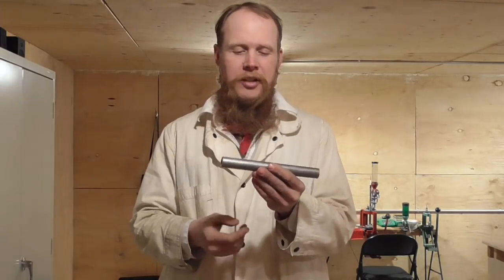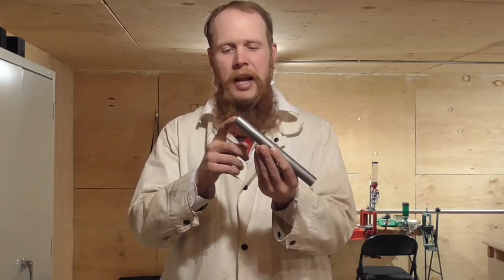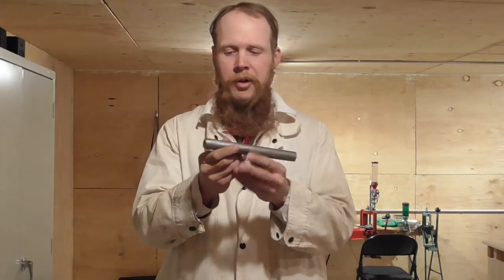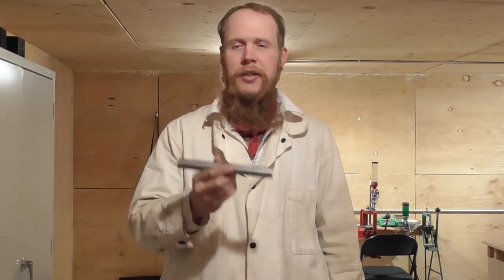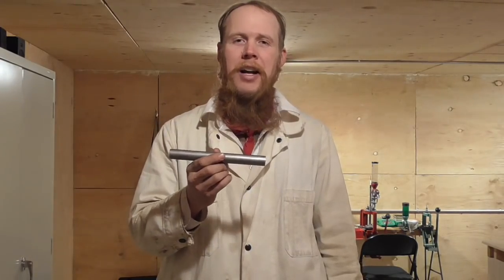To test my hypothesis, I'm going to take this piece of DOM tubing, plug one end with a plug that has a flash hole and priming pocket drilled out in it, cut some threads on it, and turn this into a barrel for my homemade Utah pistol. Then we will take it out and proof test it to see whether it blows up or whether DOM tubing is actually a viable option for muzzle loader barrels.